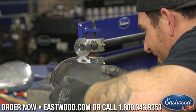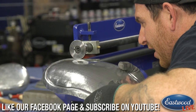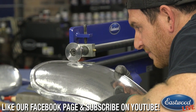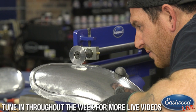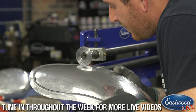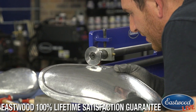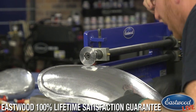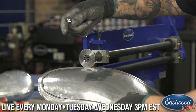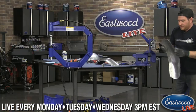All right. So we're coming around. Now the key here is to try, if you can, and marry up your lines here. Get them darn close so that they're going to marry in place. All right. Do you want to actually go backwards just a little bit? There you go. All right, good. So I had to go backwards just a little bit to adjust my line and help me blend the two of them together. You can use a little hammer and dolly action to get them to match up even better.